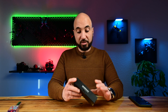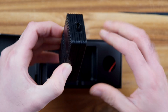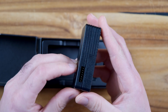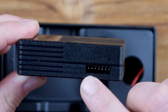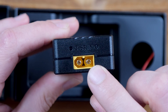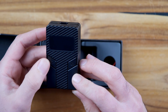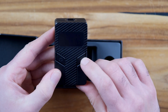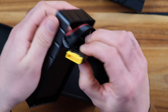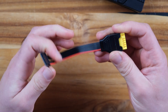In the box, it's a simple box from Speedy-B. Inside we have the device itself — it's made out of plastic, it's simple. It has a battery lead for 6S, an XT60 input, a 3 to 6S input, a power button, setting buttons, and a screen. We also have a balance extension cable, and that's all that comes in the box.